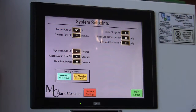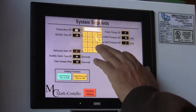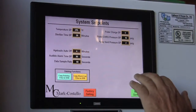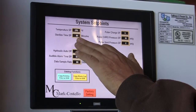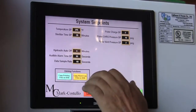On our options here, for those of you that don't know — and some of you will — setting your temperature: you push the temperature button and you'll get a calculator screen. You'll be able to put in your temperature. Say you want 275 — enter your temperature set. The time is your cook time for the vessel. Once the load is up to your 275, this is going to hold it at 275 for 35 minutes.